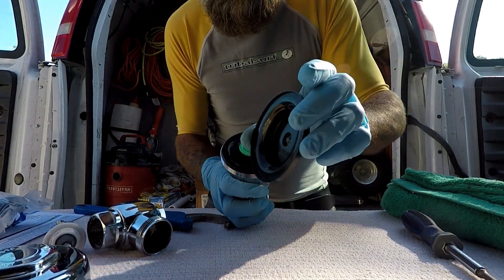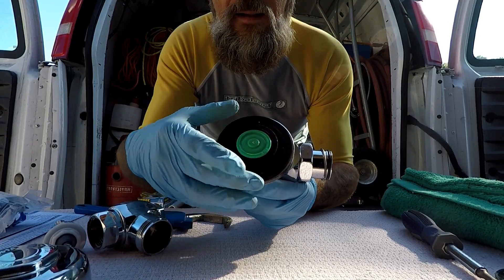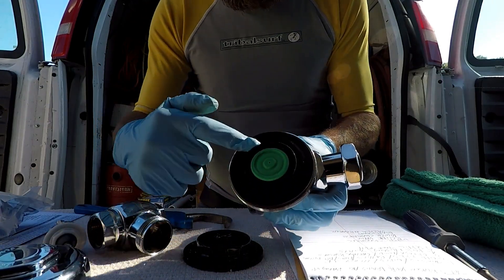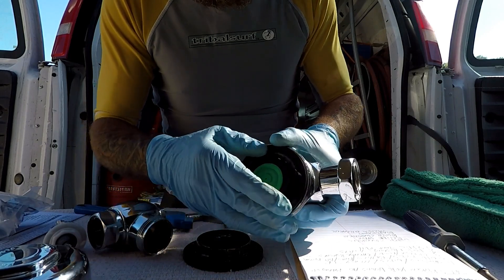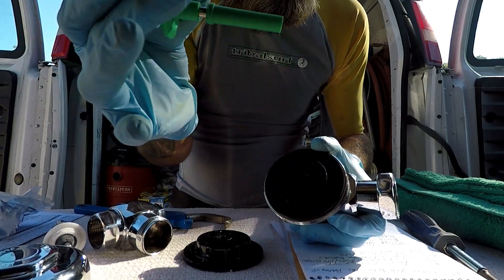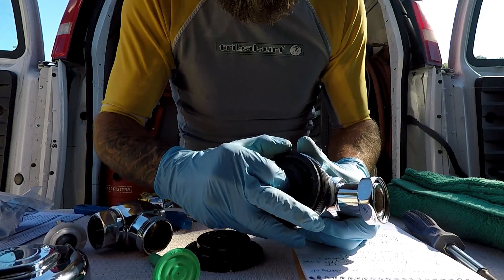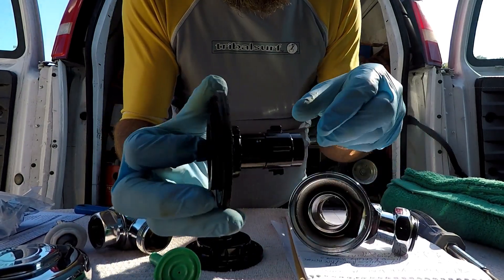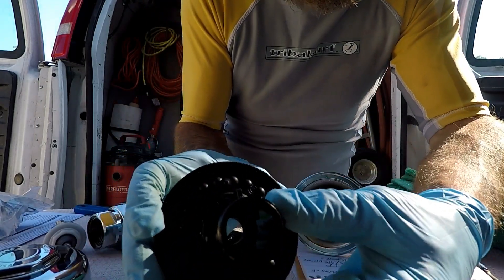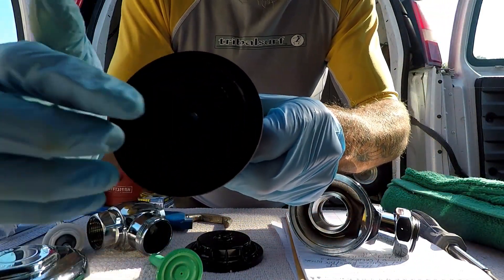This is just a plastic cover cap — set that aside. Inside we can see the components: a green piece and a black piece. The black piece is called the diaphragm. I'll pop it out — this is the relief valve inside your Sloan flushometer. You can see it has a little piece that goes back and forth through a very tiny hole on top. Now taking the diaphragm off, there's a special tiny little hole — easier to see on the bottom — right there. You can also see it from the top side.